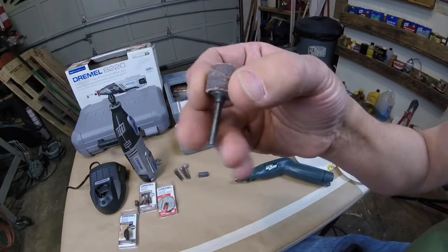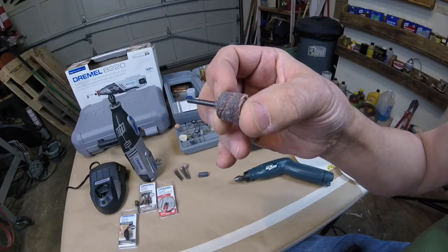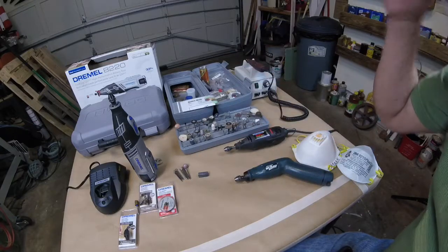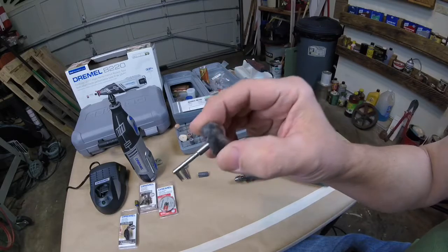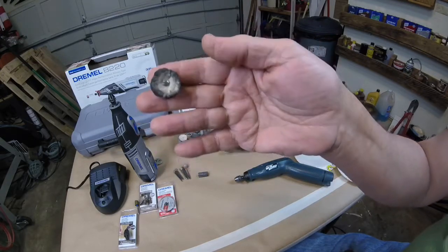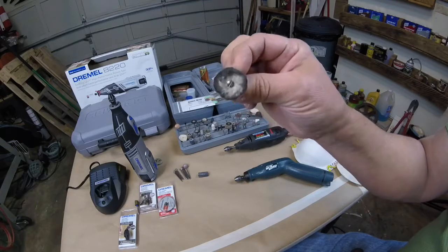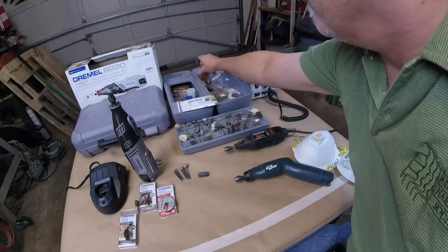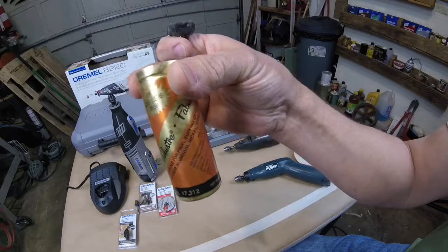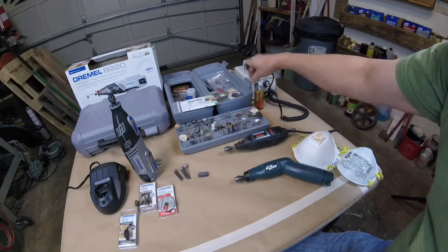This is a typical Dremel accessory — it's a Dremel brand — and a lot of these will come in kits. I use a lot of sanding discs. Probably one of the most used tools that comes with these rotaries. I use buffing compound on little buffing wheels to put a shine on something, like any kind of steel. I recently forged a sword out of a nail and buffed it. I used this compound, and it's the same compound I use when I polish arbors on my antique clocks. It's a buffing rouge and it did a real nice job on that little sword.